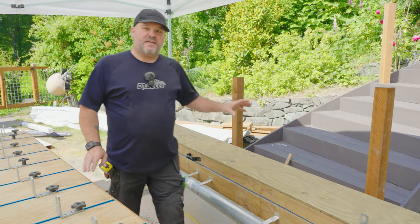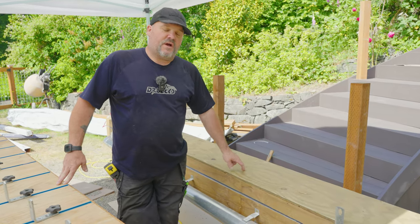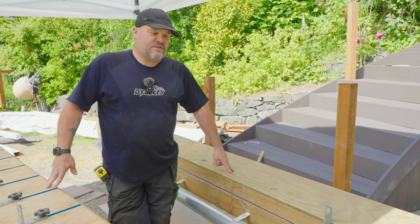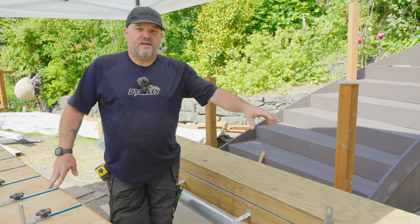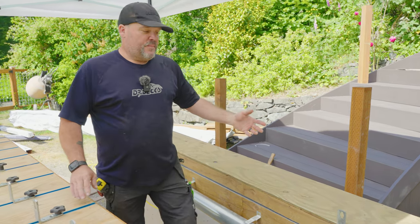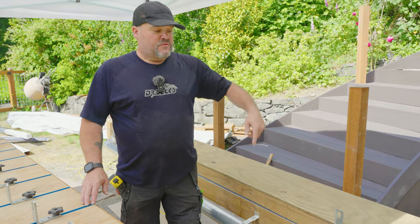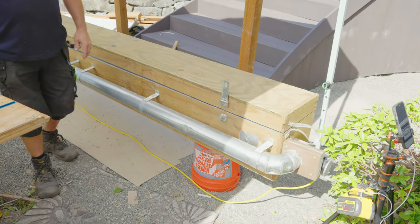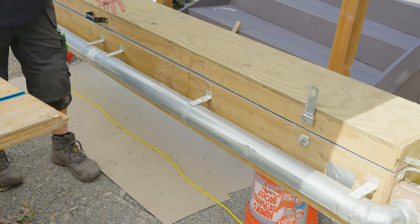There's a set of HeatCon heating blankets on the inside of this oven. I built the oven to accommodate the length of the heating blankets, which are around 10 feet. So this oven is nearly 12 feet long with the box controller, box holder, and the fan. I have improved upon the design of this box by adding a convection fan in it. So it blows the air around just like a convection oven does to help give a more equal heat to the parts that are inside the oven.